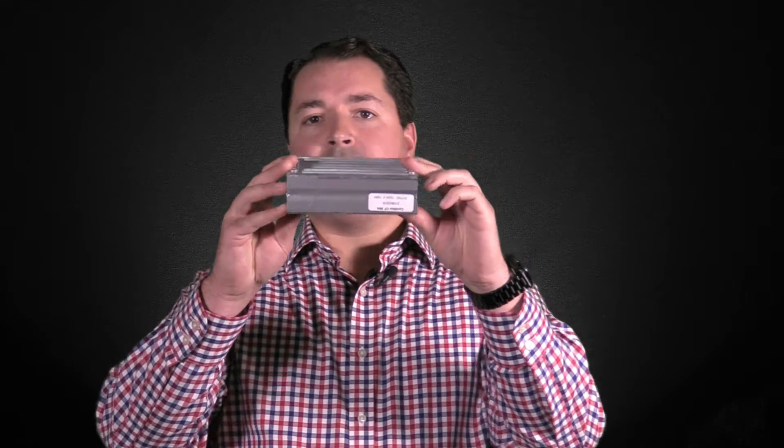This product offers you 180 minutes fire resistance — that's three hours of fire resistance in doors, walls, and ductwork. And uniquely, on the LVH44 range, you can install them horizontally, so great for ceilings. That's totally unique to the LVH44 range.